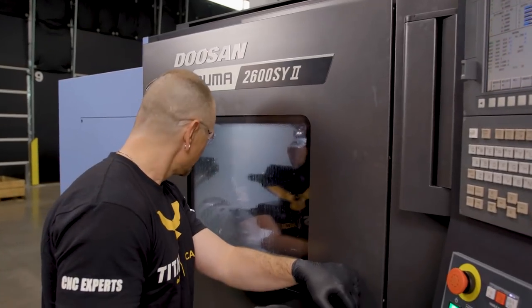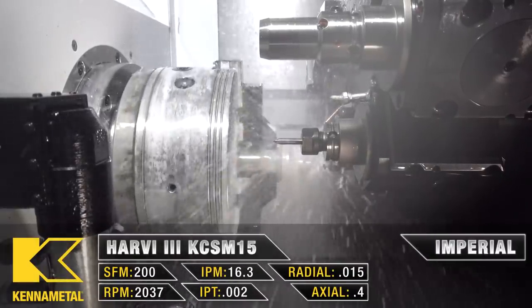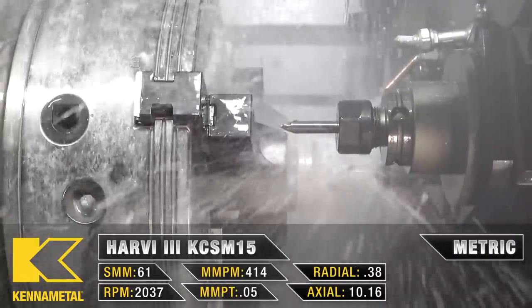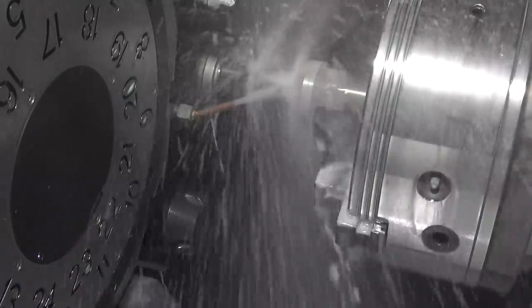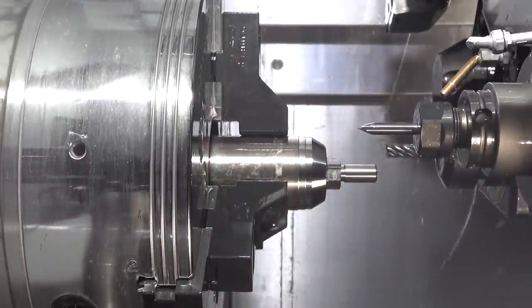For the roughing of the hex we used a 2D dynamic Mastercam path, and as you can see we're using X and C rotation to complete the roughing. As you can hear, that end mill is starting to chirp a little bit — this is Inconel 625 and the tool is getting a little worn, so you'll want to keep an eye on that as you go forward.